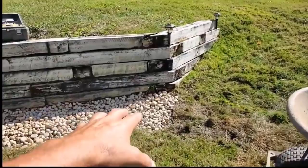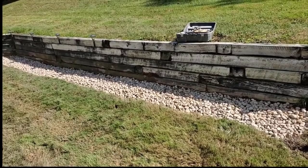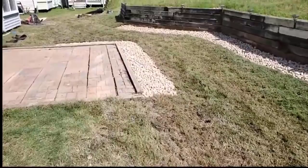It's amazing. And we have our non-woven geotextile fabric. We went with our 4 ounce because it moves water faster than the 8, and we have it put through the process twice with all the holes punched in it, and it has the highest flow rating. It flows more water than any other fabric, period, and it still has 100 pounds of tensile strength. So good stuff. Now this is looking good. This is looking really good.